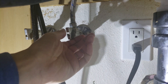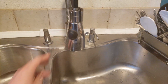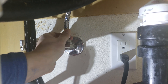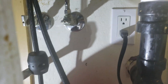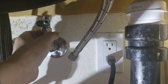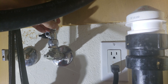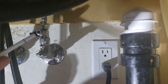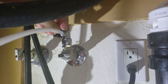My first step is to turn off the cold water valve and then run the water to relieve the pressure. I'm going to unscrew the valve — it helps to have a pail on the bottom to collect water. Now I'm going to install a new T-valve by screwing the old valve into the new T-valve on top.